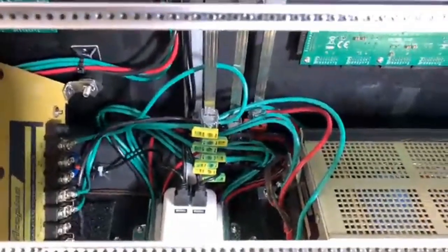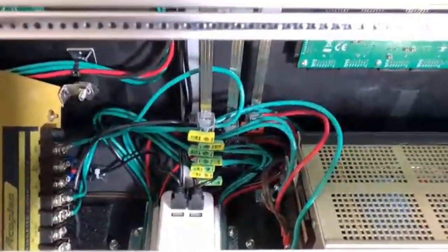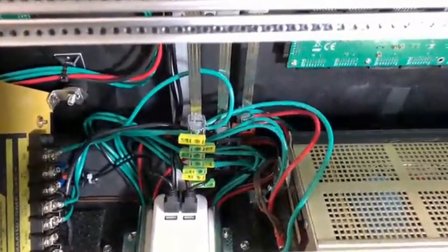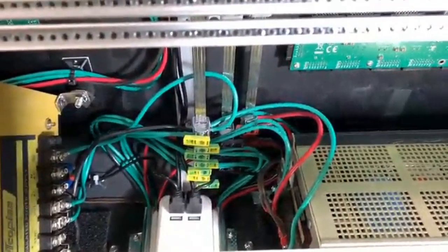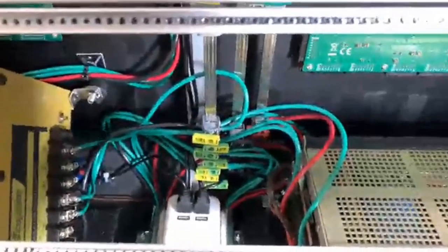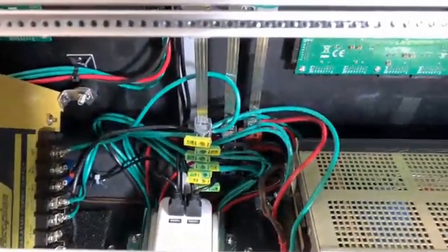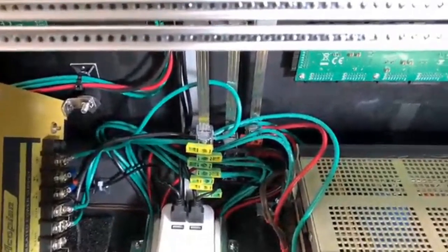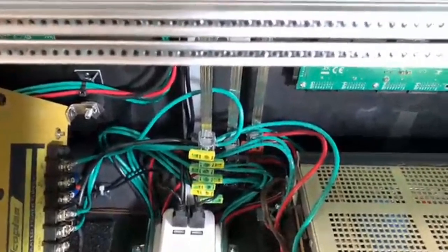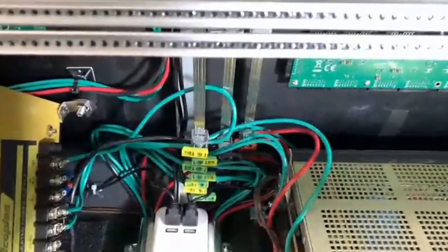Marine wire is called that because it doesn't corrode. It's very finely stranded, so it's easier to bend, and each strand is tinned, so it's not a problem with the copper corroding and things like that. And I've doubled up all of the ground runs because, as John Loffink of Genus Moda pointed out to me, the ground is carrying the return for the plus 12 and the minus 12. If you've got one cable for each of those, you should have two for the ground just to balance things out. So that's what I've done here.